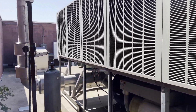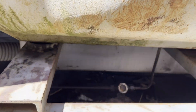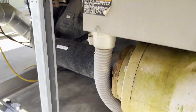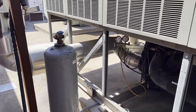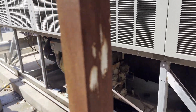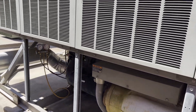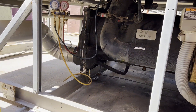We're doing a little leak repair. We know for a fact we've got a really bad leak right down there, leaking from that valve over there. Just got done recovering all the refrigerant. Each circuit holds 230 pounds of R134A. We had to pull all the gas. If you're wondering why we didn't use some sort of pump down or isolation method, we tried and the valves weren't holding, so we had to wind up taking all the gas out.